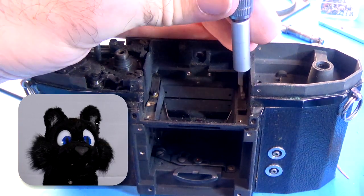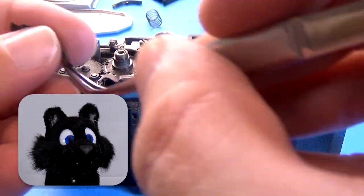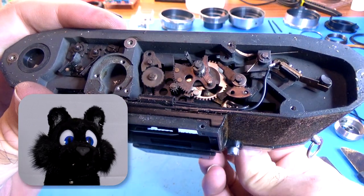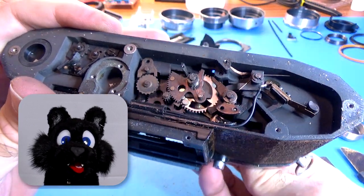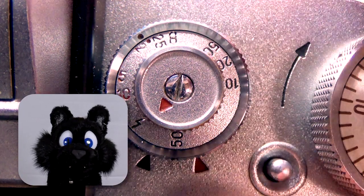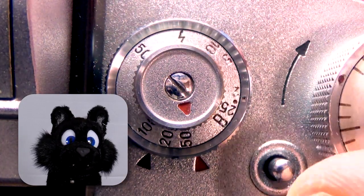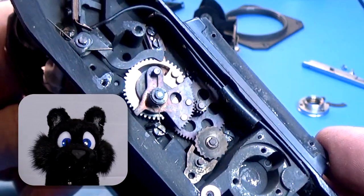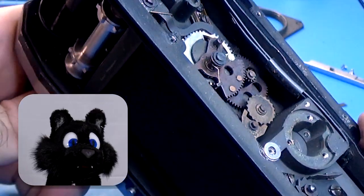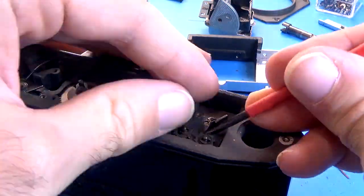The underside had some interesting parts of the timing mechanism. There is a clockwork type of device to slow down some gear movement for the longer exposure times. When you put the red-black selection into the long time position, it engages a brake for the second shutter curtain, the short time position just bypasses that. So that's why they used this weird two-part timing selector.